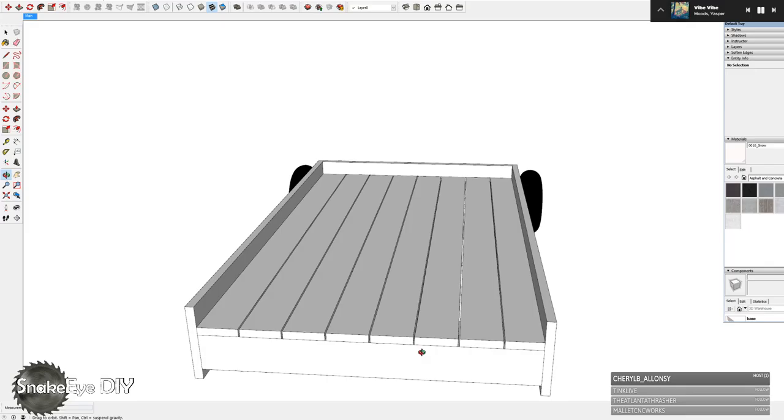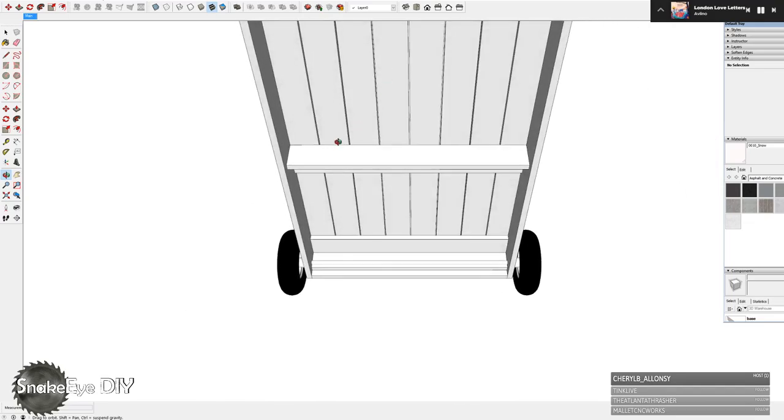Depending on if it includes the heads for 1 1/4, I'm not really familiar. I don't remember if it includes the heads for the total length, the head would go into the wood. And if 1 1/4 was the total length of the screw, including the head, that would be fine. It wouldn't go through the boards. But I would also put some glue on too. That's just going to increase your overall strength for all these joints.